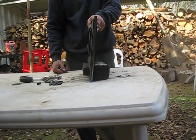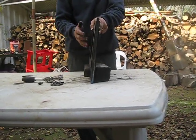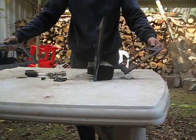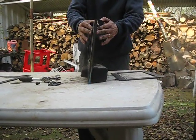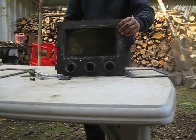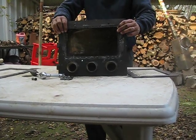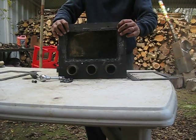I was asked how I managed to secure the glass in the stove's door. Well, very simply — as you can see I have two frames and the glass is in the middle. I used a bit of high-temperature sealant for stoves. Unfortunately it became too hard, and this is the reason why the glass shattered.